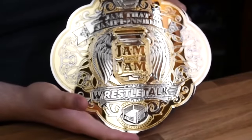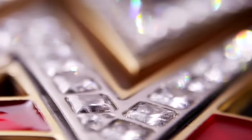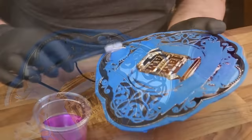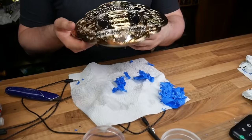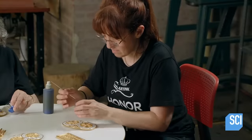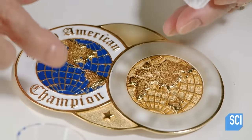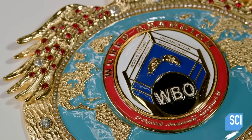The exact way of decorating a belt can differ from competition to competition, designer to designer, and year to year, but a few techniques are always used. One of the simplest ways to add detail to metal on these belts is etching — a special chemical is added to some parts of the belt, which when submerged in an etching solution creates a special texture on the metal. A more traditional method is to simply paint some parts of the belt using special enamel paints that last very long and retain their colors. The plates are first cleaned and then roughened to give the paint something to latch onto before enamelers apply the thick paint. The plates are then baked for a few minutes to solidify the enamel, resulting in a bright and lustrous finish.